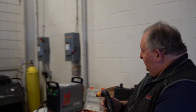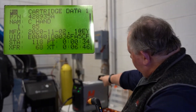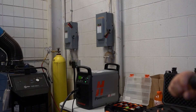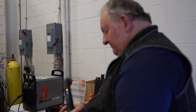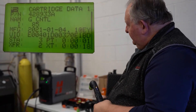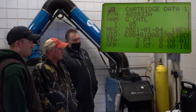You'll notice it's in cutting mode now. The reason I know that is because in the top right switch, it's green on the two cutting positions. When I change it — now I took it off — the amber light's on. When I go to put the gouging cartridge in, you'll see how it changes. Just by changing the cartridge, you automatically set the power supply.